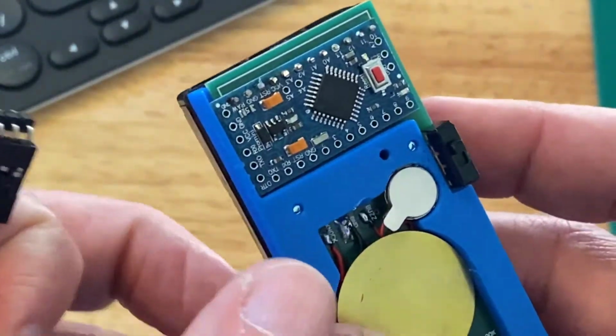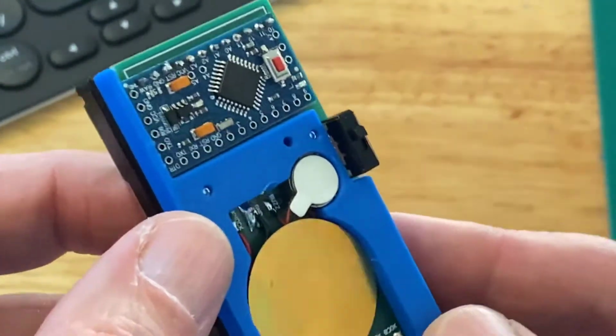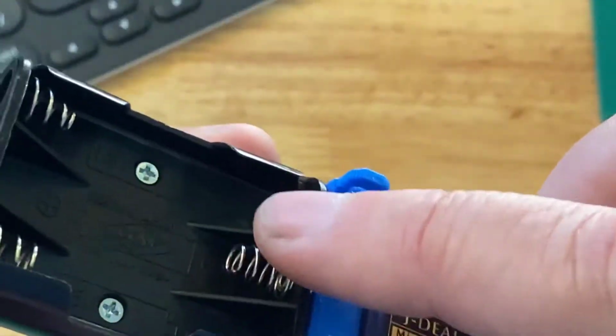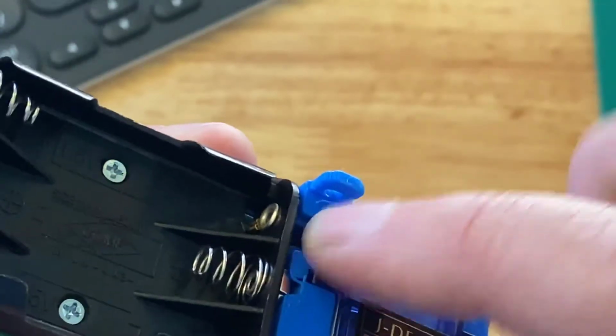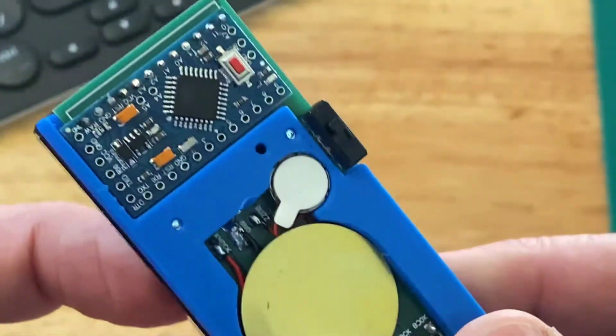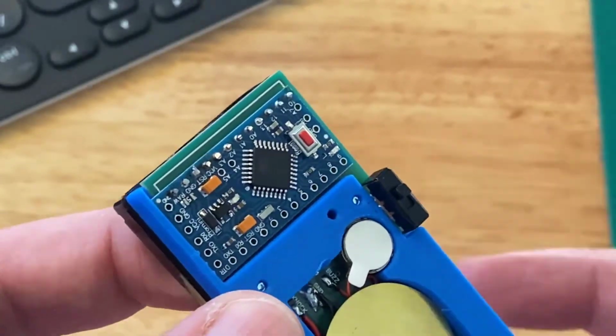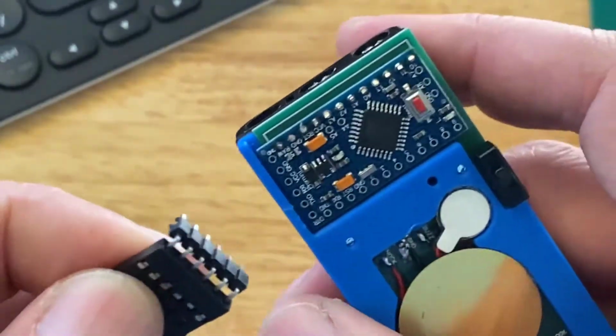Now it's important that that secret knock gets kept in EEPROM, because when you want to program your own custom secret knock by pressing the program button, it saves that in its EEPROM and remembers it for the next time you turn on the secret knock box. Very important. So first we'll upload that.